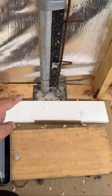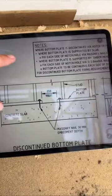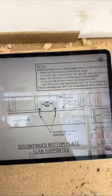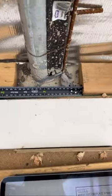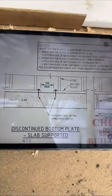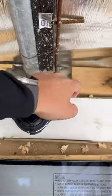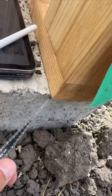The engineer does have a detail for a discontinued bottom plate which states 250mm maximum. Let's measure what we've got here — it's 175mm. You also have to put masonry nails on either side and there's nothing there.